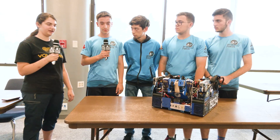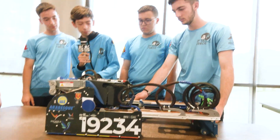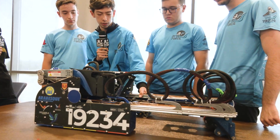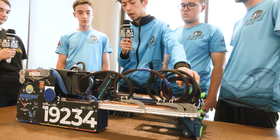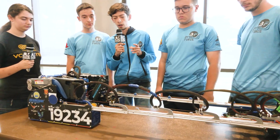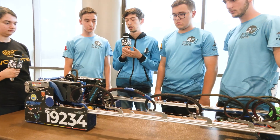Let's jump back into your robot's hardware — can you talk more about your extension? We implemented this extension mainly so as to drive as little as possible during the autonomous period, so we don't collect errors along the way. We didn't want to implement a scissor for our cable management, so we used nylon filament — about three millimeters in diameter — which gives us a telephone wire-like cable extension, and that helped save some weight. One thing we also needed to implement for this extension was our transfer, which has some motivations as well.